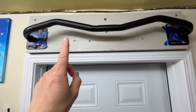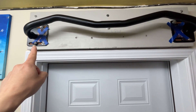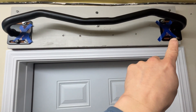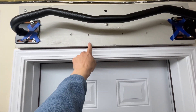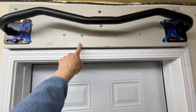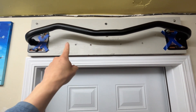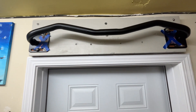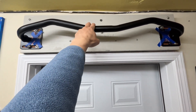The installation is pretty good, especially if you do it over a doorway. What it comes with are these black bolts — there are four of them: one here, one up top, one there, and one above. I decided to reinforce it a little more. There's a header board behind this drywall, but I also added a 2-by-10 piece here just because I wanted it to stick out more away from the door. I reinforced it with screws and also added more silver bolts for extra reinforcement. Once it's installed properly, I've never had it move or shift at all.